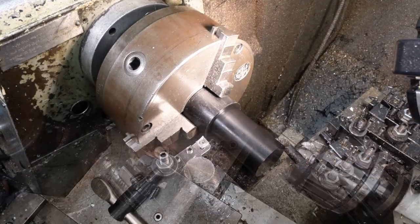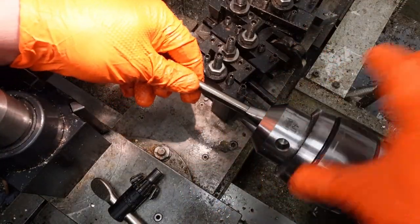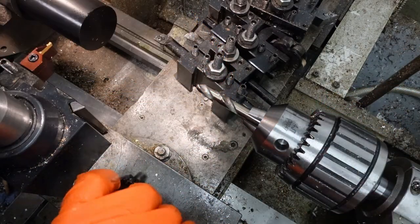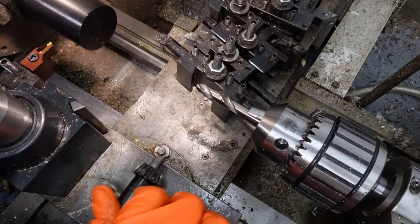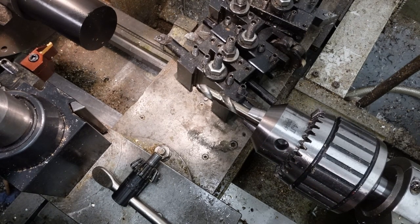The size is good so the next operation is to drill and tap the central hole. There's a clearance hole at the other end which I'm opening out to 13mm. I'm using these stub drills rather than starting the hole with a centre drill. They're very stiff and have split points so they self-centre very accurately. Not that that's an issue in Delrin obviously.